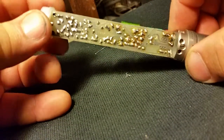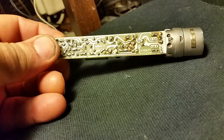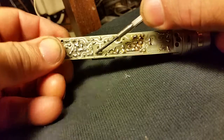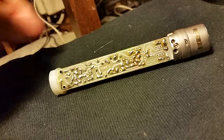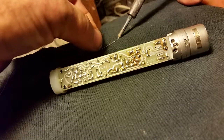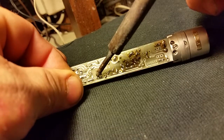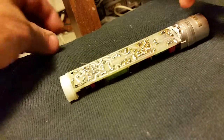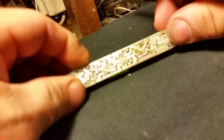And you don't want to create a solder bridge between that B jumper where the jumper was. So now we're going to put the mic down, and I'm going to install a new jumper on A. One handy way to do this is to take a little piece of wire, tin one end of it — just to get a little solder on it there — and then put it on one end of the A bridge, and then solder the second end right there on top of the A bridge. Now I've jumpered it.